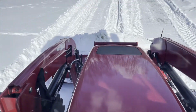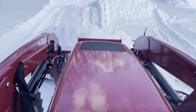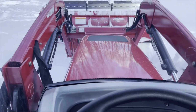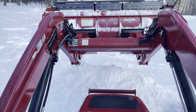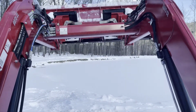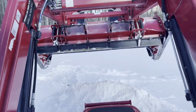It's made by Boss. It's an 8-foot, and it's got a floating head, which you can probably tell. So where your skids to your quick attach attaches to your loader, it floats and pivots and rocks and follows the terrain basically, not your loader. So those black plates that my quick attach is connected to, they can pivot up and down and rotate and rock. Let's see if I can roll this ahead for you. You can kind of see how it moves on them. Yeah, it's awesome.